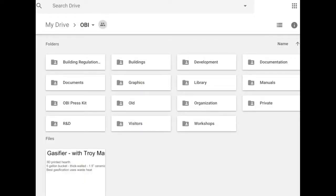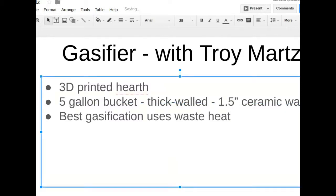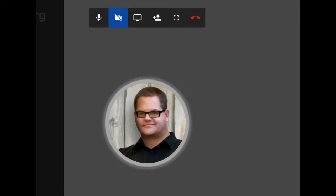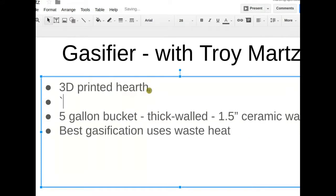This is not so different from using a 55-gallon barrel with bricks in the bottom — fire bricks used as insulation to protect from metal fatigue. Troy recently did a course at Las Queladas where a gasifier got red hot on the outside, which further cemented the idea that a ceramic core is viable. A 3D printed ceramic part — not the kiln itself — would actually be cheaper than a metal one, especially if you own the printer.